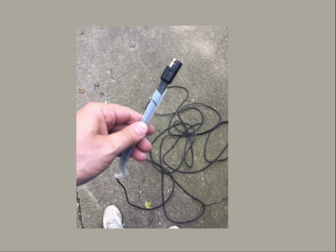Looking at the wind turbine blades from the front, you can see that the harness comes out of the lower rear side. It's got some tie wraps on it, some heat shrink. It's weatherproof. In fact, it is an automotive connector. I get these at AutoZone. What you do is you just cut it in half, and then you have a keyed outdoor weather-ready connector. I think they're like $2, not a big deal. So here's the other half of that, heat shrunk and spiral wrapped, and that SO cord is what goes into the shed to bring the power in from the turbine.